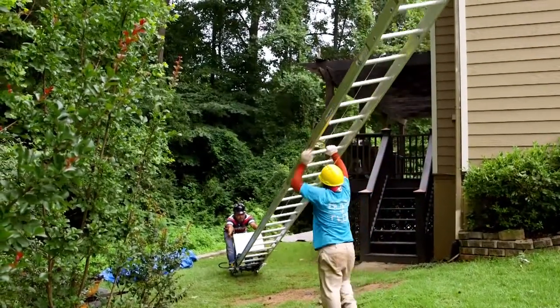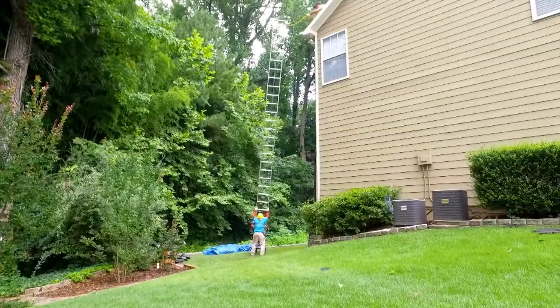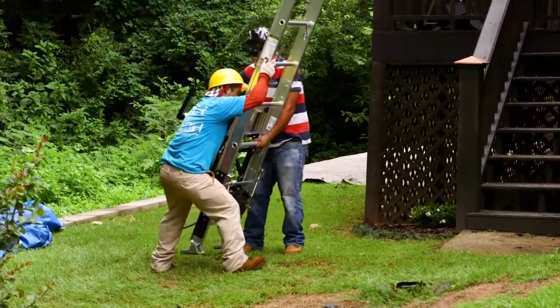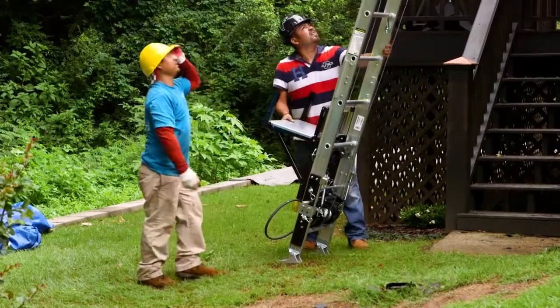The third contractor walks the hoist up hand over hand by the track runs. When the hoist reaches a vertical position, carefully rotate the unit 90 degrees and move the bottom of the base unit away from the building by a quarter of the height of the building.